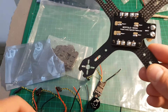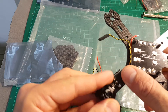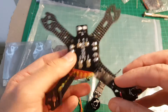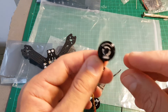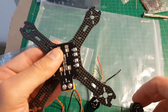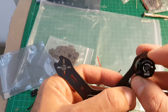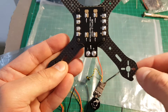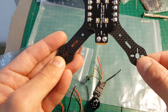Next I am going to put each motor and ESC on the frame, connecting them using the provided screws. You have to make sure you put them in the right direction — on each motor you have a rotating arrow that shows you the direction. This is going to be the front of the quadcopter. The counterclockwise motor goes here, clockwise here, then clockwise and counterclockwise here, and the clockwise motor here.